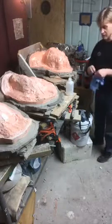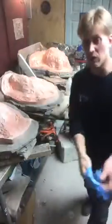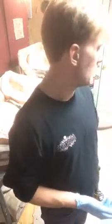And glove up. The resin, in a lot of people, when you're doing the Bondo and the resin, will cause you to break out and have rashes. So you don't really want that stuff on your skin at all. A good trick we found and we live by, and we use the daylights out of, is baby wipes. Go buy cheap baby wipes in the biggest tubs you can find. We use baby wipes to rub down the skin when you get resin on it. The aloe of the baby wipes takes the resin off and keeps you from breaking out as bad. So we try and do that as much as we can.